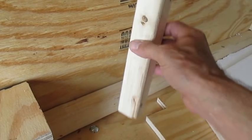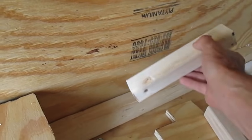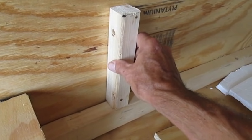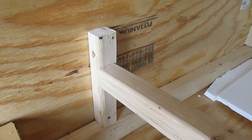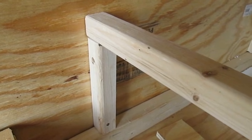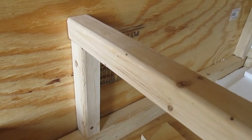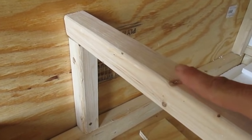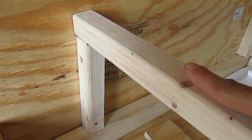In this video I'm going to show you how I make my bed risers in small campers now versus how I used to do it. How I used to make bed risers — these would be cut whatever length you needed, whatever height you wanted. This part right here would get glued and screwed to the wall, and then these would come down on top of it, every ten inches along the wall. All my cross members were like a stick frame, and then the top side would get surfaced with quarter inch plywood to create the bed surface, then it would get carpeted and you could put a mattress on it.